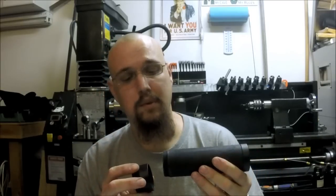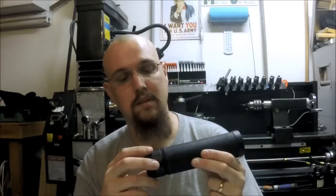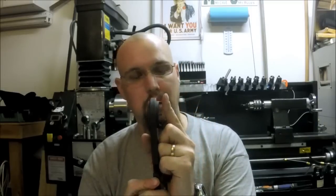This week I've got just a couple little projects I'm working on. I'm going to do a barrel nut wrench for an AR-15 barrel. I have a Hogue overmold foregrip for an AR-15 receiver that I'm building for myself, and the hole pattern is recessed in where the tube threads on, and it's a little under half an inch deep. And the standard AR-15 armorer's wrench doesn't even come out a half an inch, so it's not going to work, so I'm going to have to make my own tool for it.